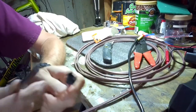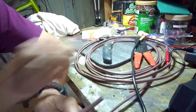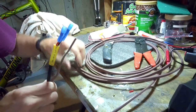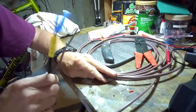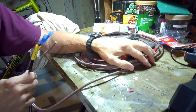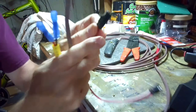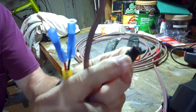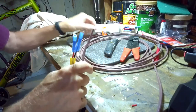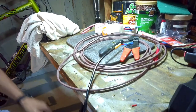It doesn't matter which wire you hook up to positive or negative here, because you won't determine that until you come down to the plug. You just take it outside, find out what's positive or negative in this wire with your meter, and then hook up your wiring according to how it is in the trailer. In my trailer, the covered side is the plus side, and the negative side is the open side. Of course I rewired my trailer, so I don't know how yours would be — you're going to have to determine that when you get there.